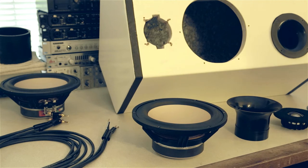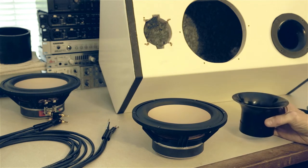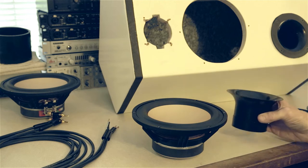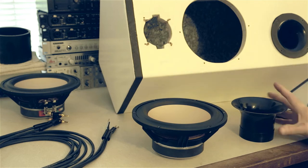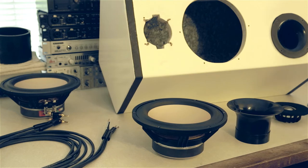The first change I've made has been to place the vent in the front of the cabinet. Let me talk about my thinking about why I was placing the vent on the back side of the box. I began doing that a couple of years ago with all my vented alignments — I was placing the port at the back panel. I was not putting it any longer in front, though historically I always put the vent in the front panel.